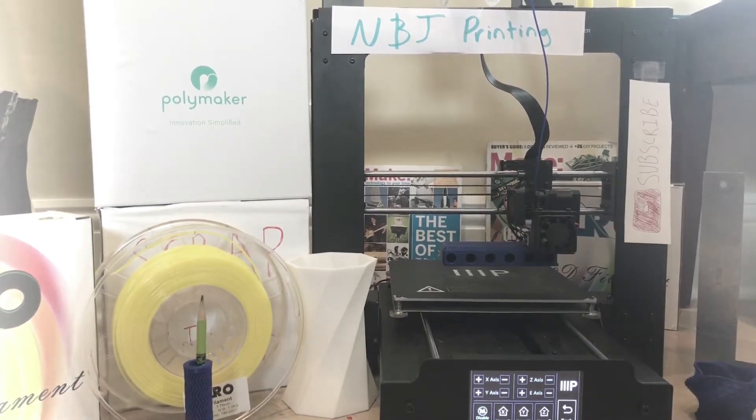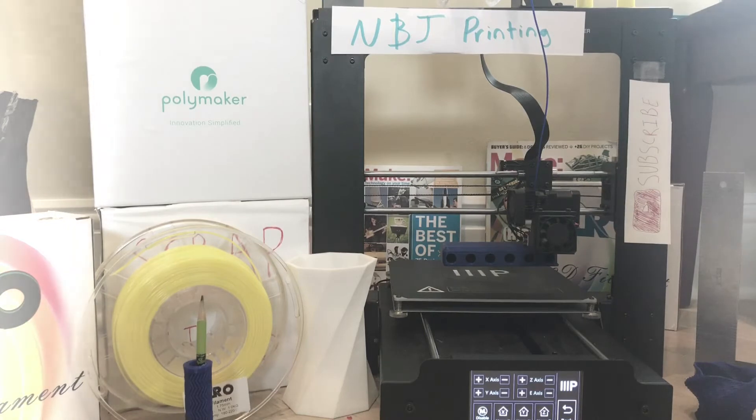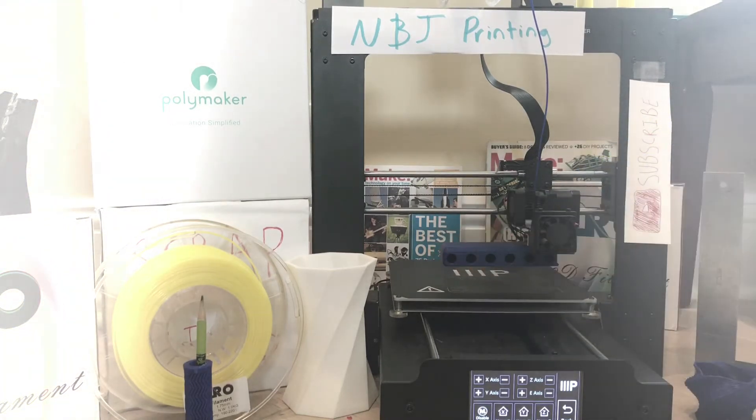After it's up with the part, put your hand around it and check — make sure it's cool, because if it's not cool this will not work. The filament parts will stick to the extruder and make it even worse. After it's cool, you're going to start slowly pulling it off. This is what you want to see.